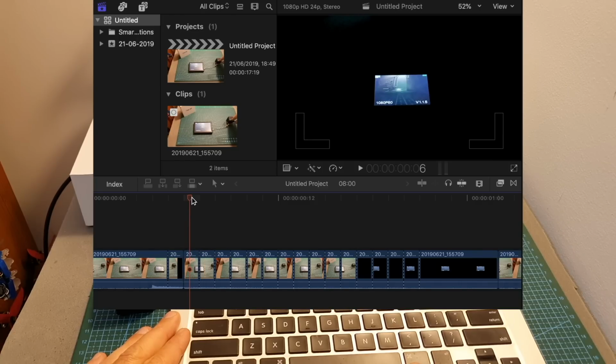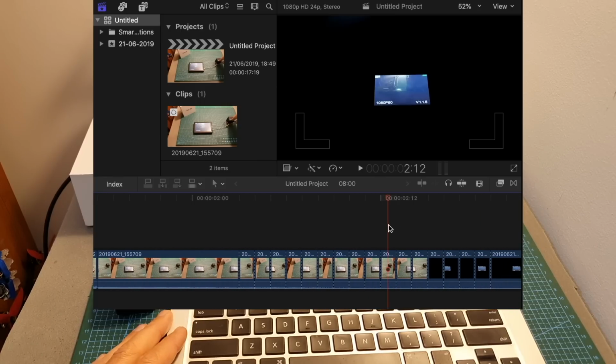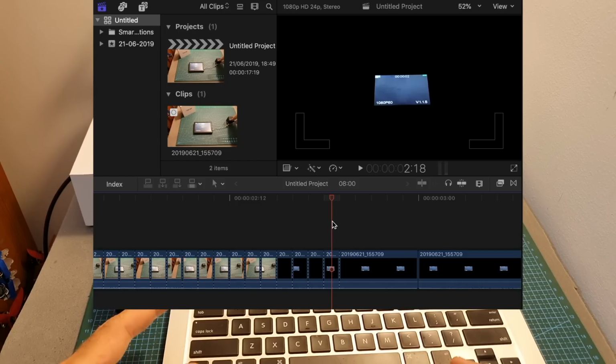The number of frames that it took for the screen to go completely dark is 16 frames, and I also tested it when the camera was recording, and the result is about the same. So 16 frames equals about 64 milliseconds. So I wouldn't use this camera, of course, for racing, but for freestyle and, of course, on an RC plane, it should be more than enough.